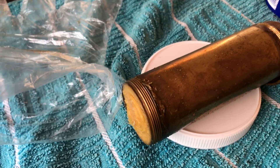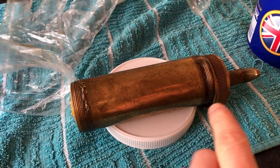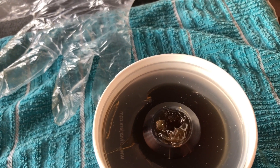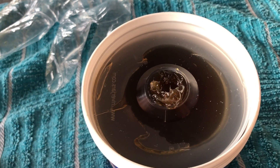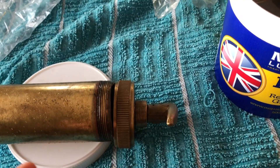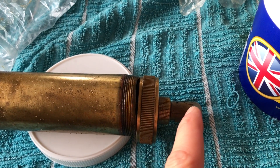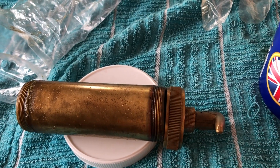I've put a sacrificial tea towel down on the worktop. We've got our tube for the grease and I've unscrewed the top. My intention is to put the tube over the centre part and force it downwards, so the tube over the top pushes the disc down into the tub, forcing all the grease up into the tube and pushing the lid and piston upwards as the barrel fills. Then I'll screw the cap back down, leaving the piston up top — basically ready to cram the grease down into the stern gland.